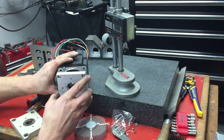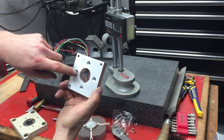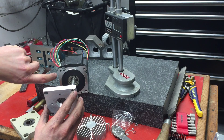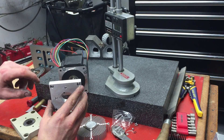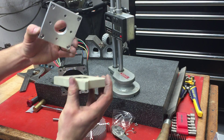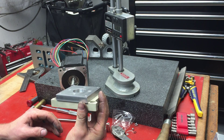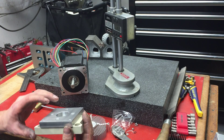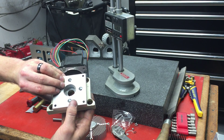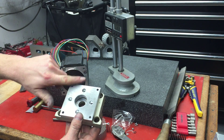These line up with that, and these guys line up with the ones on there. They're reversed because these ones are going to be coming from the bottom going up into the standoffs. So they need to be flat so this piece can mount here. Those are basically recessed or countersunk, and these ones here are counterbored as well, so the head of the screw should be below that surface.